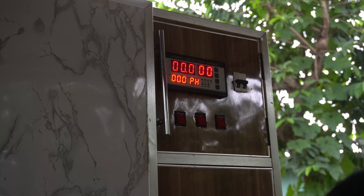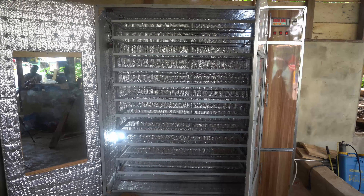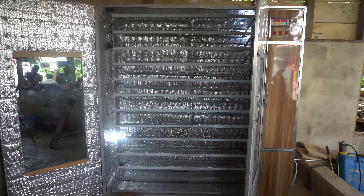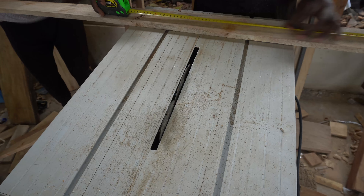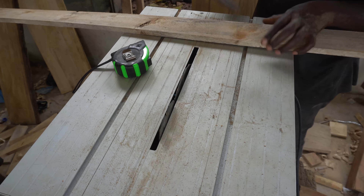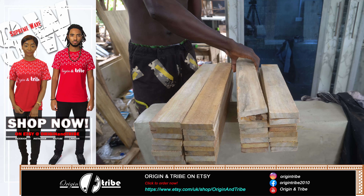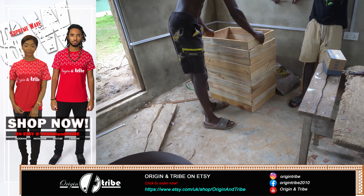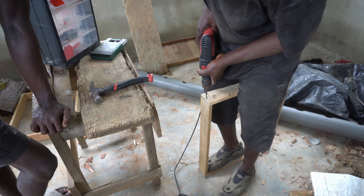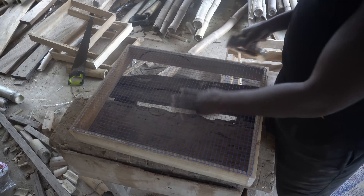We connect the main plug to a power source and turn on the incubator now that all parts are completely installed and connected. The final part of the incubator are the egg trays. I would caution against building one large egg tray for each egg tray seat if you are considering using my egg tray seat dimensions. I advise you build a minimum of two and a maximum of three trays for each level. This will reduce the weight on each tray and the pressure on the wire mesh when you load them with eggs.